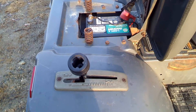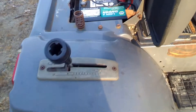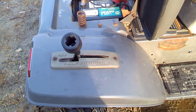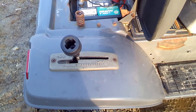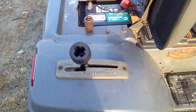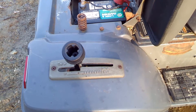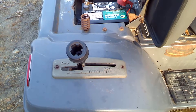If you don't have full throttle engagement forward and reverse, you'll lose power — it will just sit there and spin. I had to actually file out the slot in the forward and reverse and very carefully adjust it so that when you depress the pedal it throws it into neutral. I thought I'd rather have it favor forward for power since I use this for grading my yard, but I found out if you plow into something with great power and then don't have good power pulling back, you're in a mess.